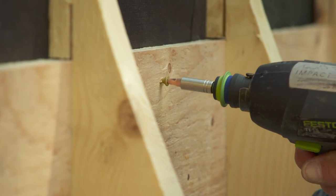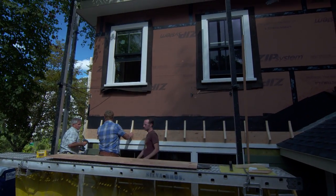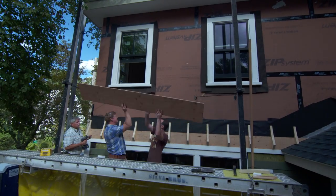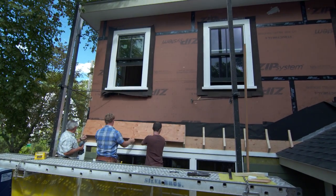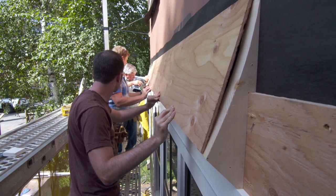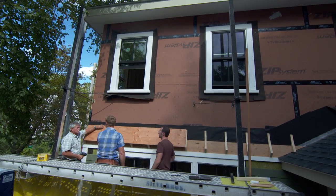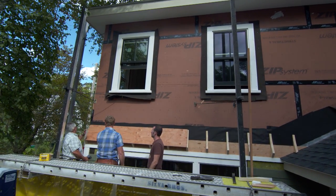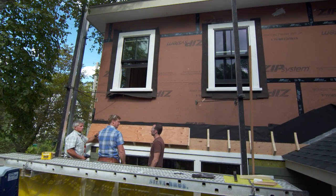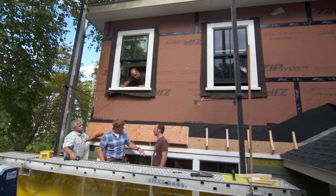Get the curved stud assemblies up on the wall and screw the plywood on, keeping it up about an eighth of an inch off the bottom. The screws will pull the plywood right in to follow that contour. Fill in the rest all the way around the house and then start to shingle, with crown molding right there at the transition. That's going to look really great.